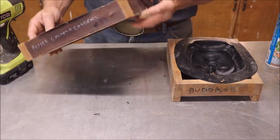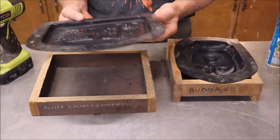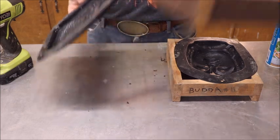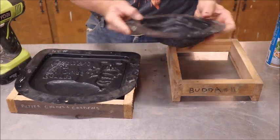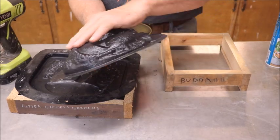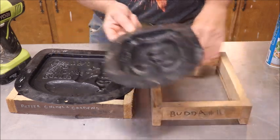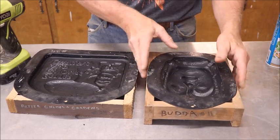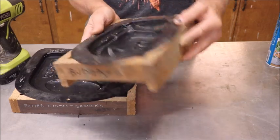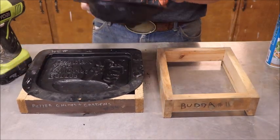The other thing you're really going to have to do is build a mold box to hold it flat around the edges. Some of these molds will sit rather flat — you probably wouldn't have to build a box for it, but I do. This little Buddha right here has a lot of relief, and if you just lay it on the surface you're going to cast it on, it's going to wobble around. You will be required to build a mold box. You can build them out of anything — this was built out of old recycled particle board, I've built them out of plywood. Build it so it fits down in there. They'll all be different sizes and you'll have to build one for almost every mold.